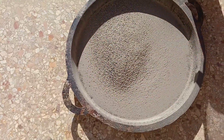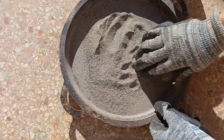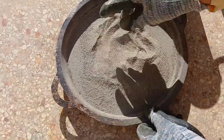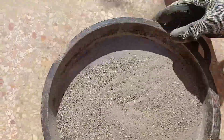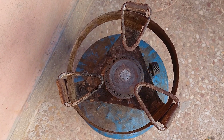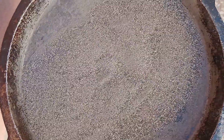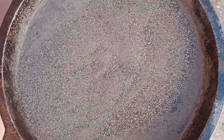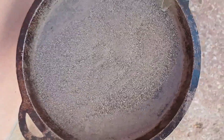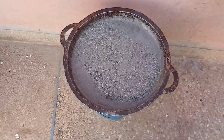How to perform roasting: grind the rocks into a very fine powder. Place the powder in a special furnace or heat-resistant crucible, and start heating slowly to avoid sudden explosions. Gradually increase the heat to around 600–700 degrees Celsius. Ensure the area is well-ventilated, as roasting releases toxic gases such as sulfur dioxide. After roasting is complete, allow the powder to cool before moving on to the aqua regia treatment stage.